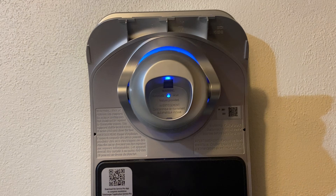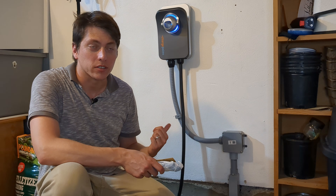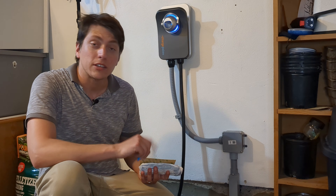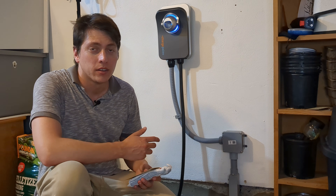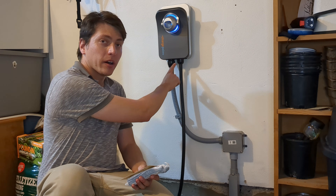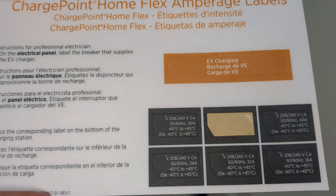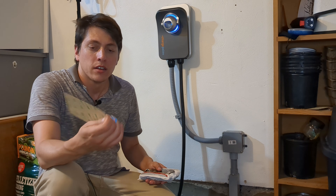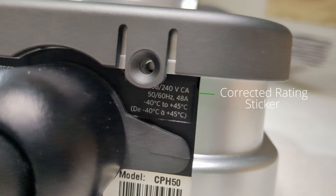The unit's LEDs will also blink blue when charging. So I pulled a permit with the City of St. Paul prior to installing this charger, and when the electrical inspector came out, he had only two things to say. First, he checked the nameplate and noticed it's wired for 48 amps on a 60 amp breaker, but the nameplate only had 40 amps written on the bottom. I went back to my pamphlet and saw that stickers came with the unit to apply to the bottom, denoting the configured capacity and breaker size. So I found the 240 volt, 48 amp sticker, applied it to the bottom of the unit, and we're good there.